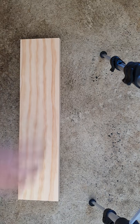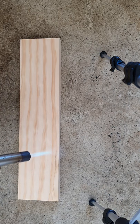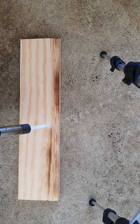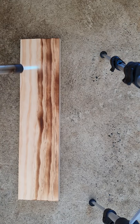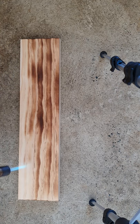When I do it I try to make sure I get a good evenness going through. Regardless, you're still going to get differences just due to the wood — we can't dictate how it's going to move. My torch is on; I hold it quite close. I just slowly try to do it at the same speed and distance each time, and I'll just do two quick pass-overs. It's freezing here at the moment, so this is actually warming me up a bit. My husband's locked himself inside with the kids and the dogs so I can do this in peace and quiet — I'm in the garage.